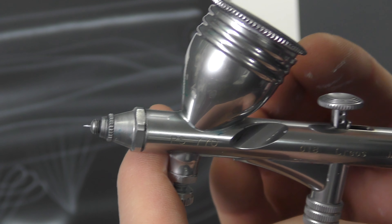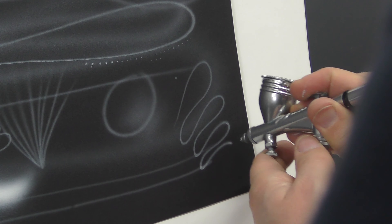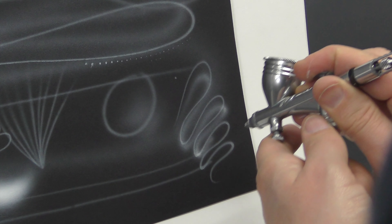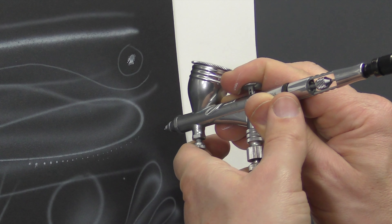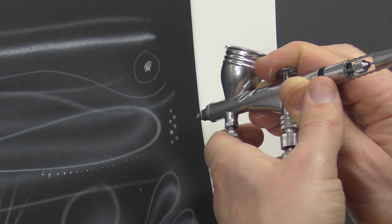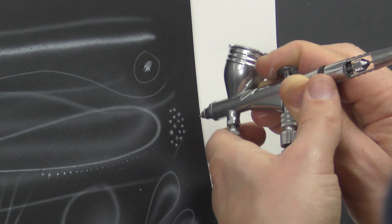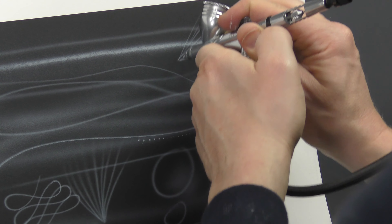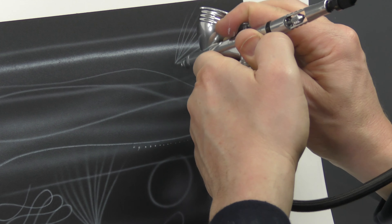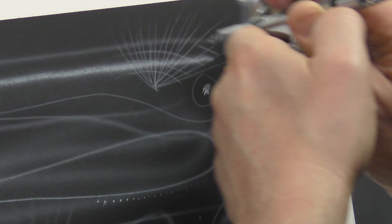I'm getting nice coverage but I am starting to get tip drying again — that's common and much more frequent when using white, so don't freak out about it. It also depends on what brand of paint you're using, as every brand will be slightly different. Water-based paints have come a long way — they used to be extremely cloggy with constant tip drying, but the technology has improved so much. I hardly ever use urethanes anymore; the water-based is easier to use, easier to clean up, and you don't have to deal with potent smells.